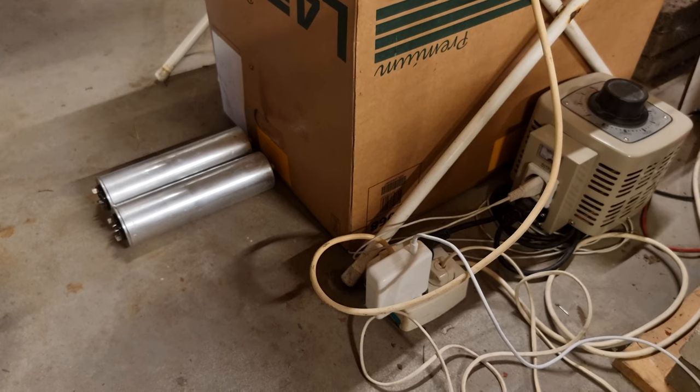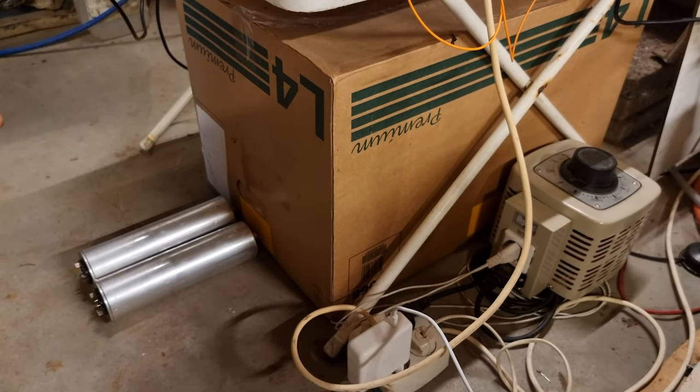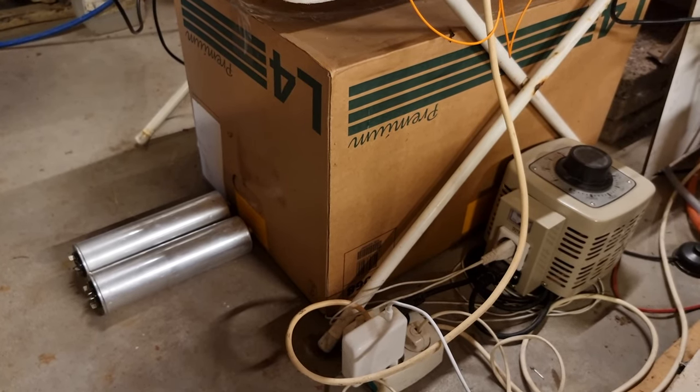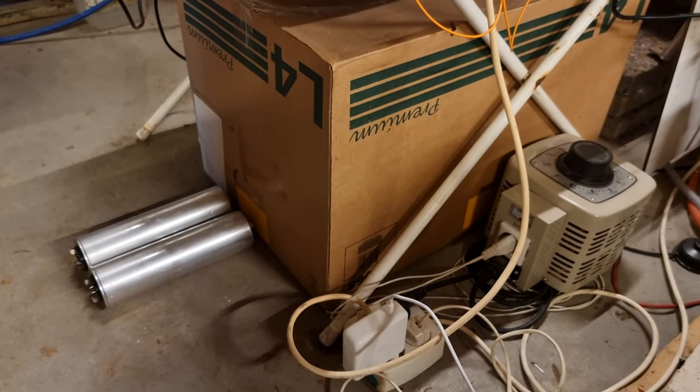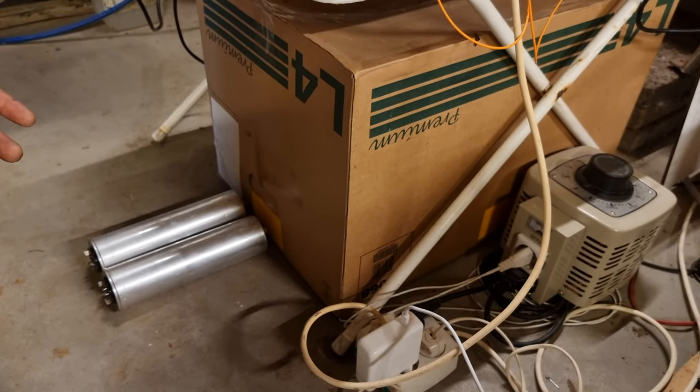It's a double one, so it's a 100 hertz version, you can say, so I get more amperage out of it. It uses only two sets of capacitors, but I want more current in the system, and more capacitive current, another phase in the current-voltage relation, because the other supply makes an inductive current, and this is a capacitive current. And indeed it functioned. I didn't see the signal on the scope yet, but you can see the behavior of the plasma has changed.